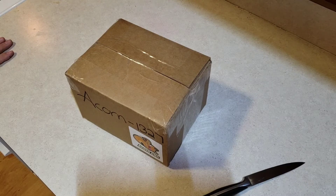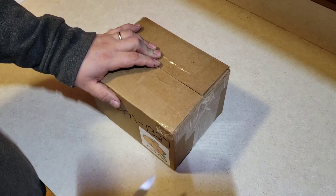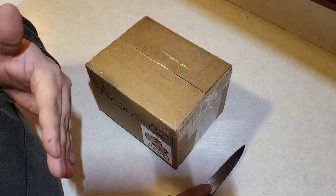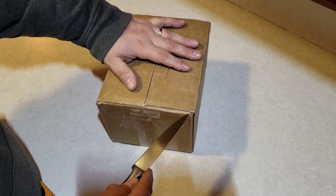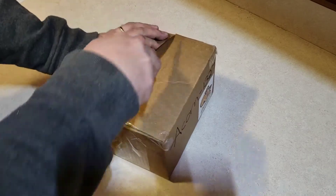I'm going to get this going and I'm also building an enclosure for the lathe. I've ordered closed loop steppers, so we're going to convert over to Acorn, put in the closed loop stepper motors and drivers, and get that lathe running more precisely. One feature I found out about after ordering the Acorn that I'm absolutely looking forward to is ball screw mapping — you can map for inconsistency or inaccuracy in your ball screws, which for the X-axis is really going to help dial in part tolerances for bearings and things like that.